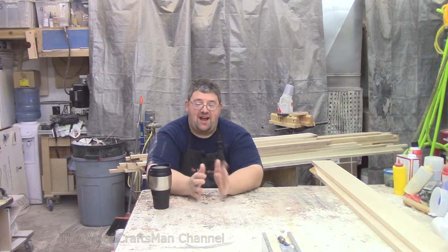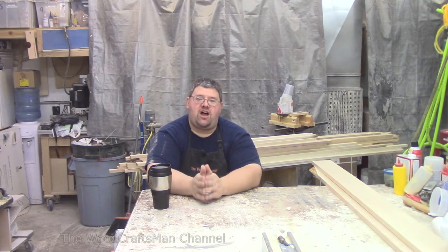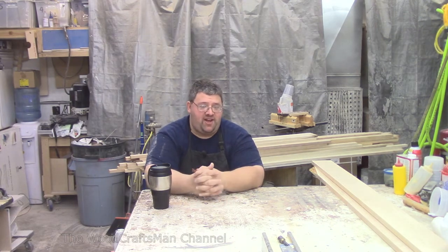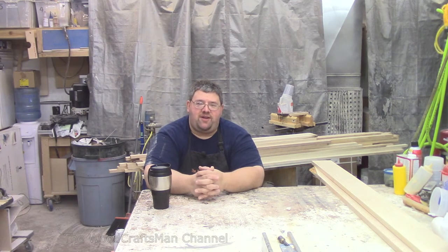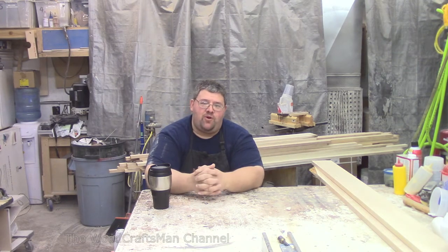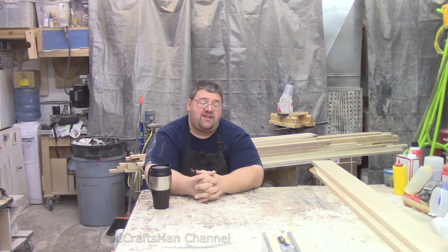When I got that, I originally was just going to put it in the warehouse, put it on the dolly, and let it sit for a couple of years. I had the motor, I was starting to piece this project together. And then I had this bright idea: why don't you just speed up your current dust collection blower for the time being and see how well it's going to work for you, because you're going to have the same type of volume with the new blower, but you're going to have more distance behind it. And so that's what I did.